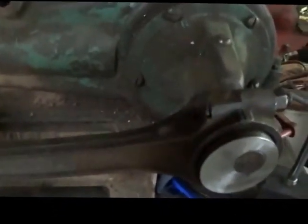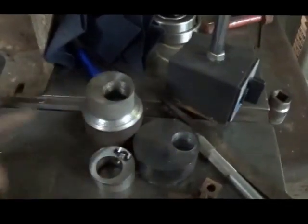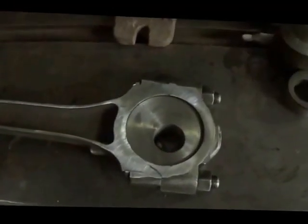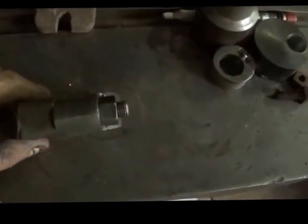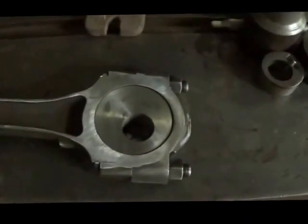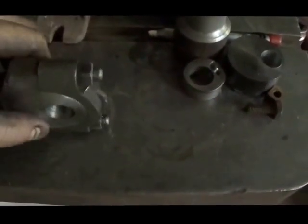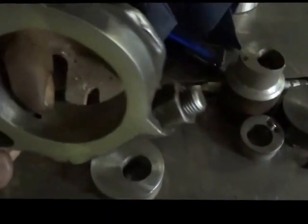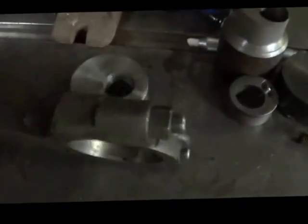I sort of like the looks of it. I'm going to get back at it. Good thing I'm not a machinist! Okay folks, we got the rod narrowed up here, and you can see it's basically the same width as the offset on our eccentric. This is metal to metal, turns really good in there, and I've done a little honing on it to make it nice and smooth. One thing — we need to make sure we get good oil over this. There's actually a hole, you can see it right here, it comes in from the top right here, but it looks like it's really small or closed off, so I'm going to drill that hole out and make sure it's good and open so we won't have any oiling issues when it's on the engine.